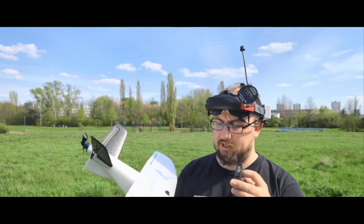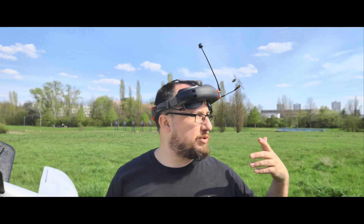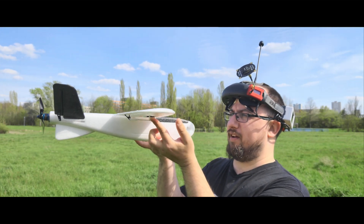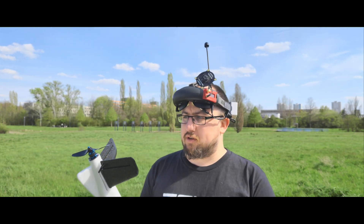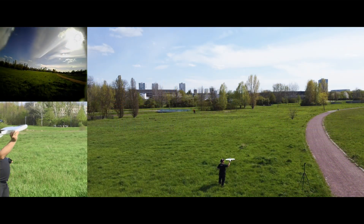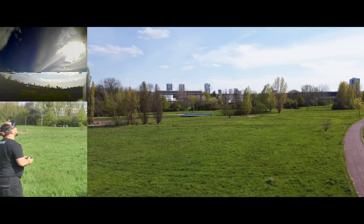What I did is replace the LiPo with a 2S lithium-ion 3500 milliamp-hour pack. This one is a little bit heavier by just a few grams, and I can push it forward. It's also shorter so the center of mass of the battery itself is more towards the front. I was able to balance it perfectly on the CG, and this time the maiden went very well — a very easy launch.